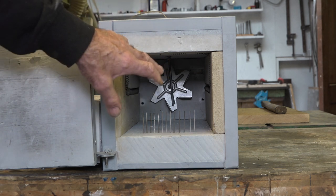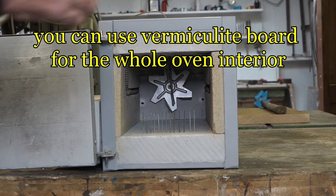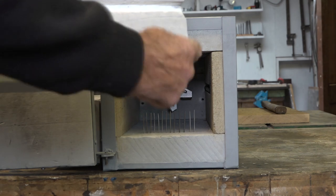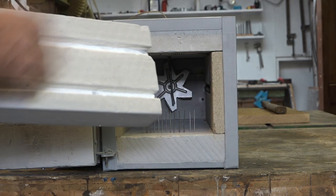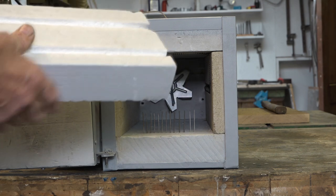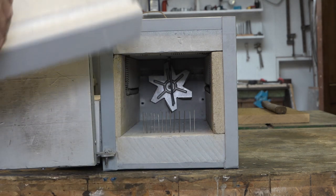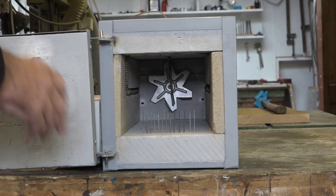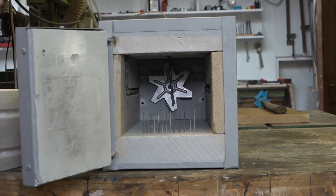This is my second go at building this oven. The first time I made it I used the elements from my heat treating kiln, which I'd swapped out for the heavier elements, and I put a two-element rig in it — the element came in, crossed over, and came up to another element on this side. The massive problem was because there was so much element in this little oven it overshot the temperature really fast — 70-80 centigrade — then turned the elements off, and because it's so insulated it took 15 minutes to come back down. As soon as it turned the elements on it overshot again, doing that for 15-20 minutes. Of course as soon as you open the door the elements go off again, so that had to be scrapped.